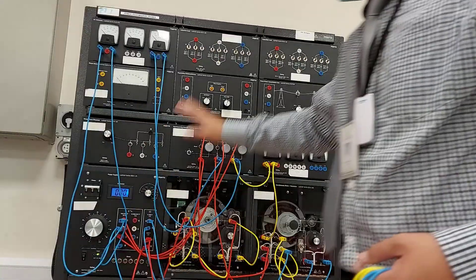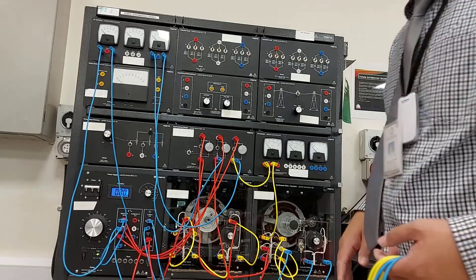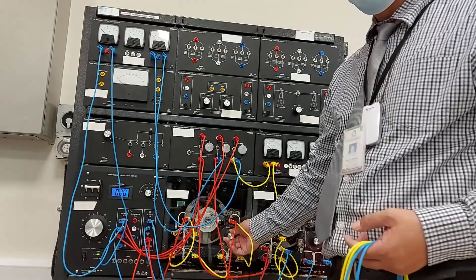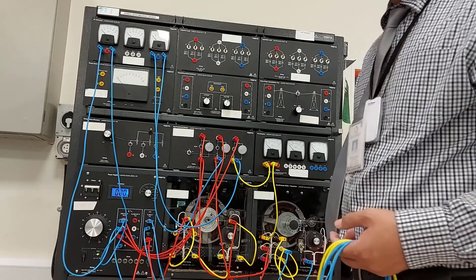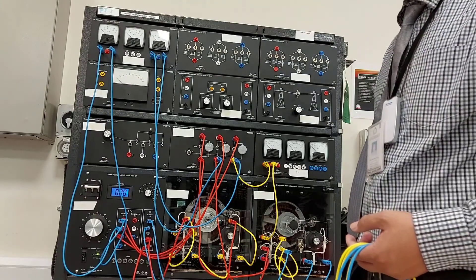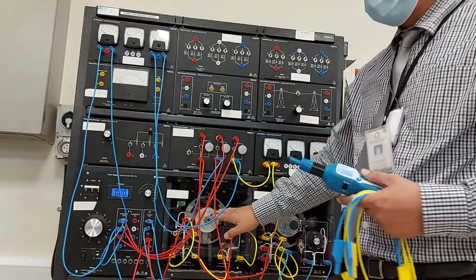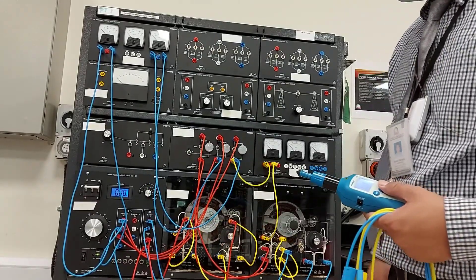That's the complete set of connections for your alternator synchronization circuit. Set the DC motor to start at full field — minimum resistance. Place the sequencing switch in the open position, then turn on the power supply and, using your hand tachometer, adjust the power supply output to bring motor speed to approximately 1,500 RPM.